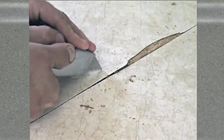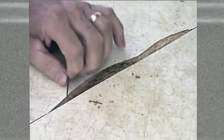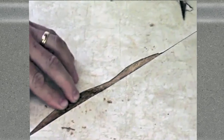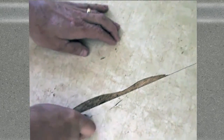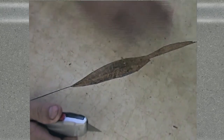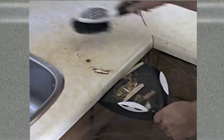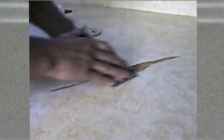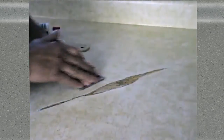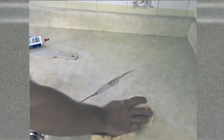Large unsightly holes, seams, and cracks in your old laminate countertop or table that could transmit through your brand new finish should be filled. Here we have an open seam and a crack where water has penetrated repeatedly, causing the underlying wood to swell. To fix this, we just cut away some of the damaged, loose laminate and swelled wood with a utility knife. Remove the debris and sand some of the surrounding laminate to rough it up and remove any sanding dust.